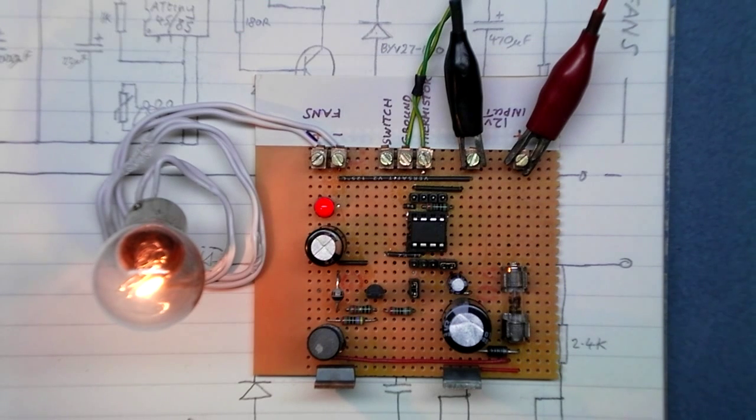when it's on low. And that works by you just pressing and holding the button for 4 seconds, and it does what you've just seen there. It just fades the fans up and down, and when they're at a speed that you want them to run at continuously, a nice slow quiet speed, you can just press the button and it programs that speed in, and it stores that value in the EEPROM.